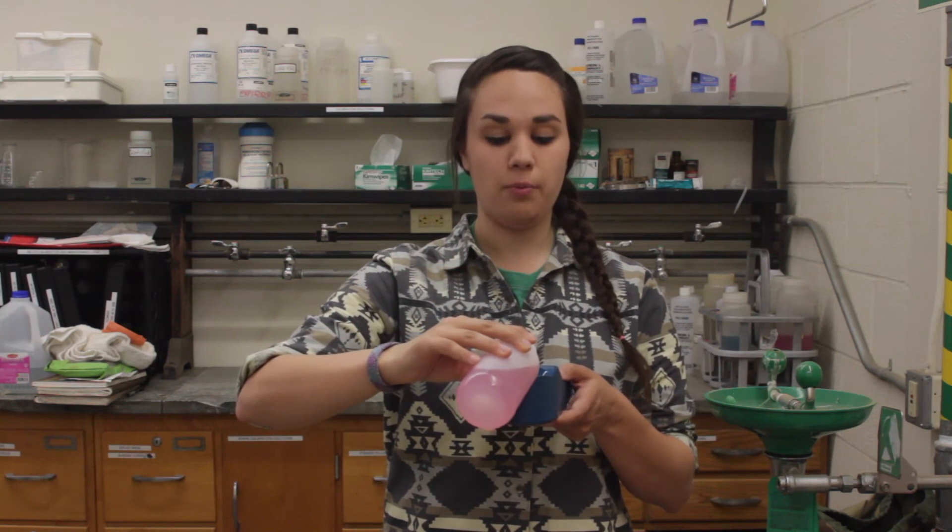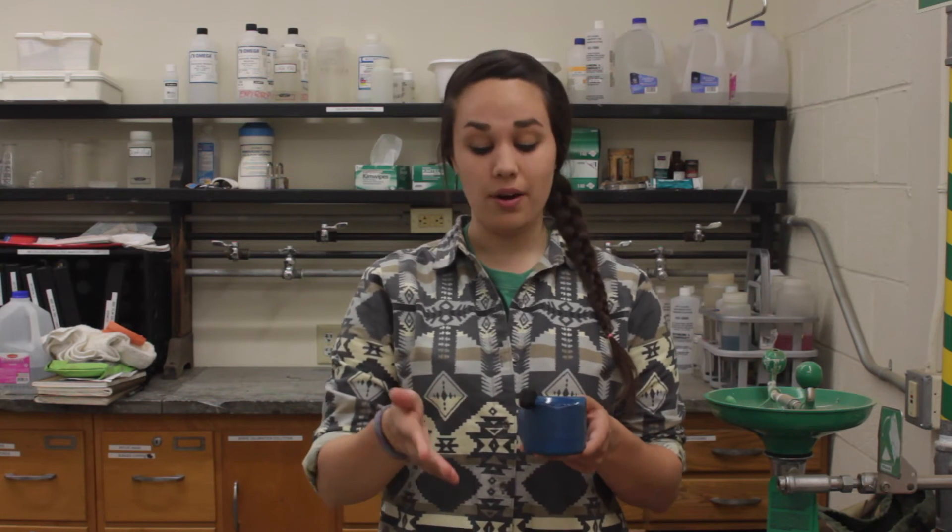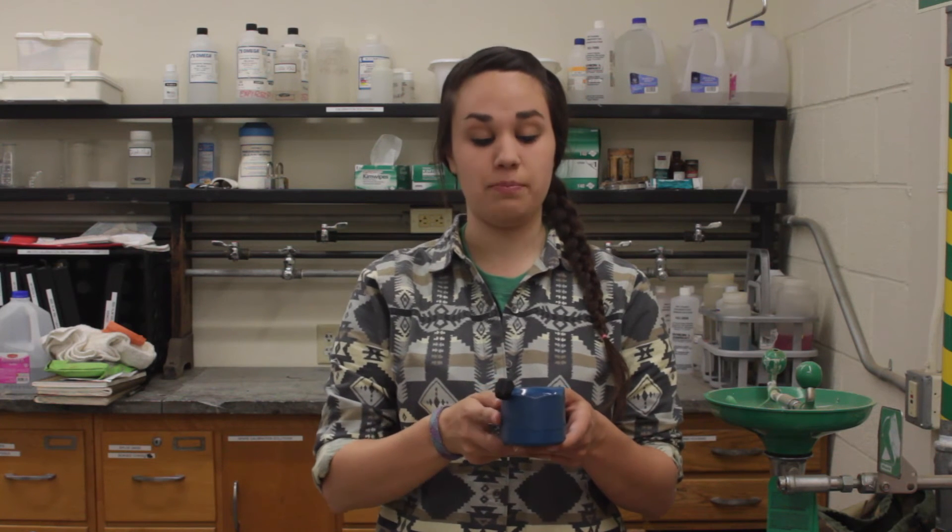After the triple rinse, I'm going to use that same solution to fill both wells, and I'm going to adjust the meter using those arrows until the display reads 4.00, since I began with my pH 4 solution. Once it reads 4.00, I'll push the calibration button.